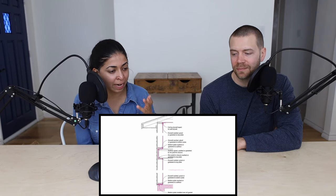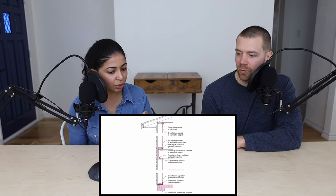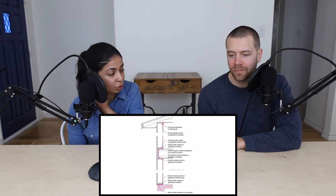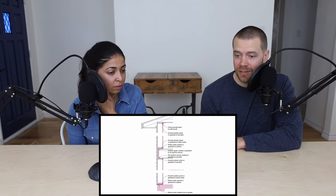So we know Tyvek is a good moisture barrier and the material itself can serve as an air barrier. However, it has to be installed correctly — with properly overlapped and sealed seams — to be considered a continuous air barrier. There's a really good website explaining air barriers, which is a complicated subject everyone has a different opinion on. It shows four most common ways an air barrier can be achieved in a building.